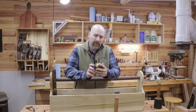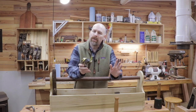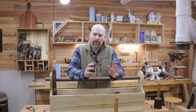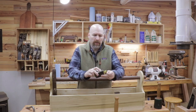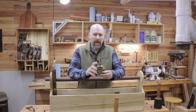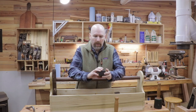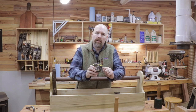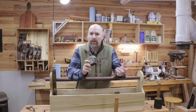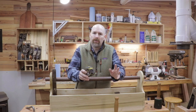The second tool that I have in my toolbox is the Stanley Fatmax 25-foot tape measure. Most of the timbers I'll be using for this project will be probably in the range of 13 to 16 feet in length, so the 25-foot tape measure should suffice. I've been using it a lot in the shop, but it's going to primarily be used for the timber frame project. It is important for a project like this to have one tape measure and to use the same tape measure throughout the process, because some of these things can vary a little bit, and we want consistency through the joints.